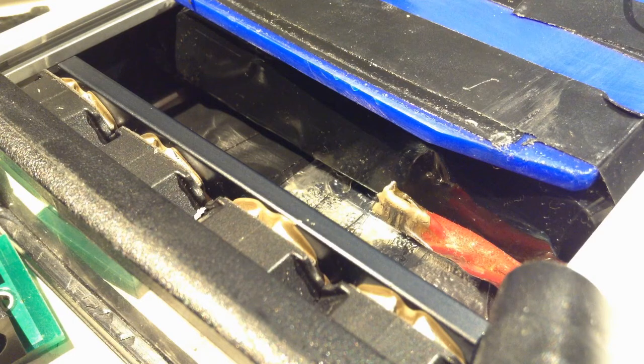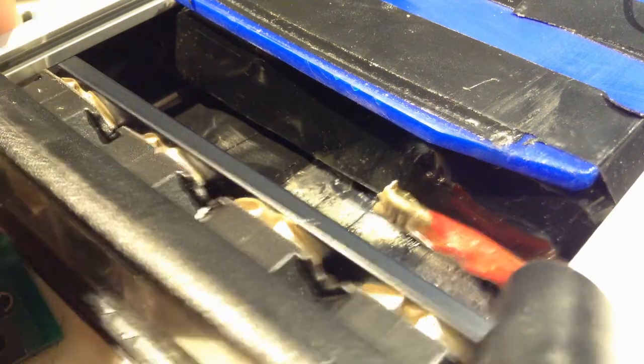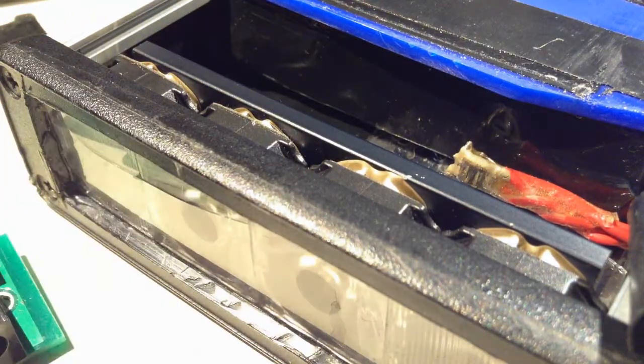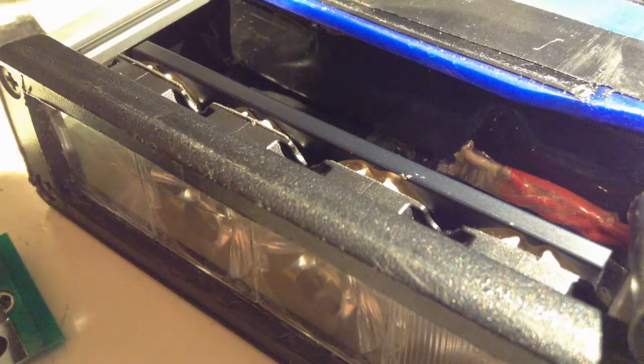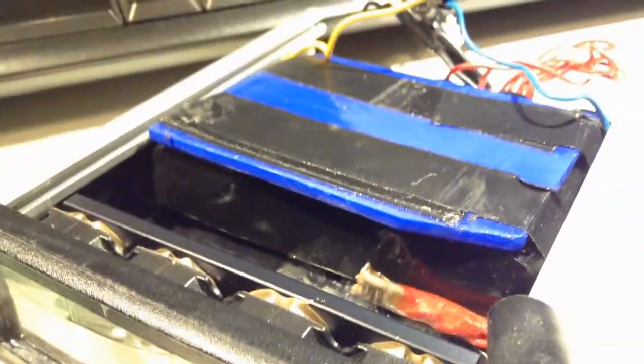The first one is like a warning, like 50 degrees, I think, such that the lights go down. And then if for some reason this light is in a closed environment, like in your rucksack or in your bag, and it's on, the 60 degrees is because you don't want more than 60 degrees C on your batteries. Anyway, so this is just hacked together with 5 cells of lithium ion,